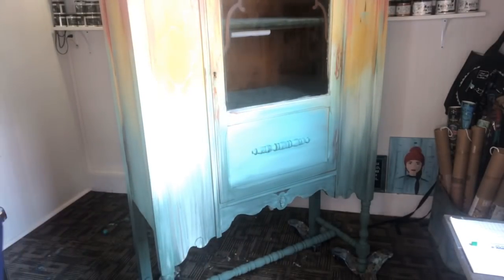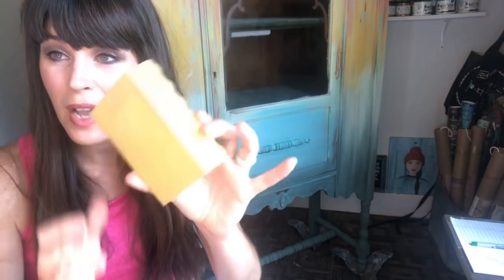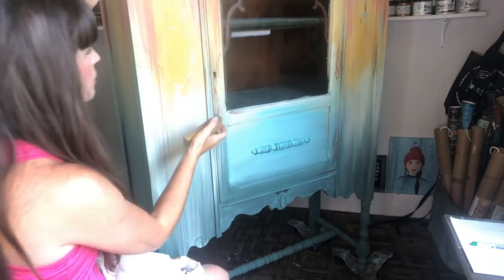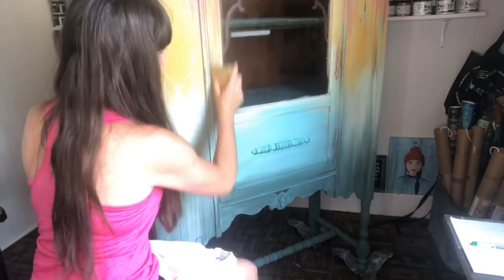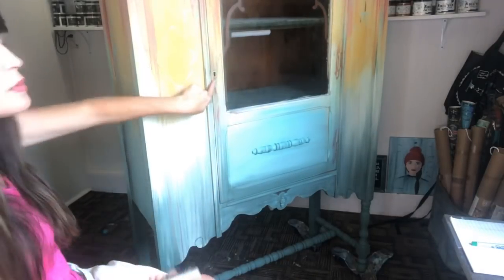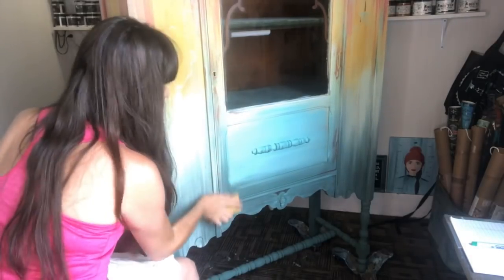Here's what we're going to do. We're going to wax, but first I forgot to say we're going to do a little bit of sanding first. I've got my fine sanding block. I'm not going to do a whole lot, but I'm really just going to do it around the edges. I also want to do a little bit here around where the hardware is, because this is where you're naturally going to have more of a worn-down finish.